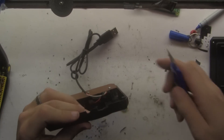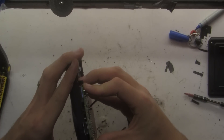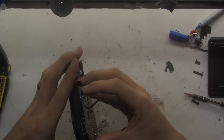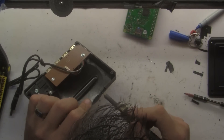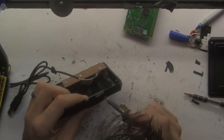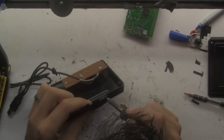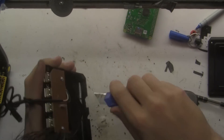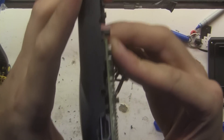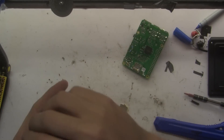Actually I think I'll just leave the fine tip on because the knife blade is really thick and I don't think I can do very precise work with it. So that's the HDMI hole there — let's just clean it up, connect it with some melted plastic, let it cool, then grab a knife and clean up the melted stuff on the outside. I might grab my Dremel with a sanding disc and clean this up a bit. Test fit — I'll have to go a little bit higher on that, but that's okay — better not to cut enough than too much. I can go over with my Dremel or soldering iron and slowly increase the size of the opening.